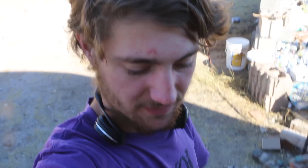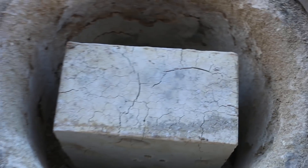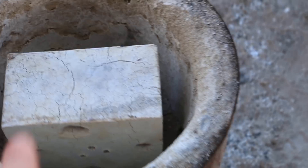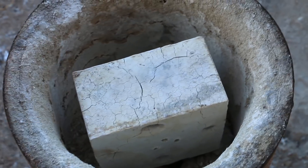I thought the burnout was done, so I stopped the fire. Not looking good. As I suspected, the bigger mold just shattered — I figured it kind of would. I think I put it in too wet; I don't think this was completely dry when I put it in. These other ones have been drying a bit longer, so I'm assuming they're dry. I'm going to basically put them over the top of the furnace, slowly heat them, then drop them in to get them preheated before they hit full heat.